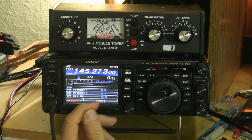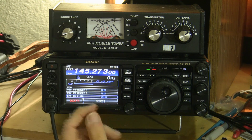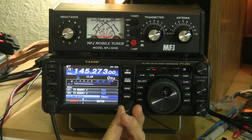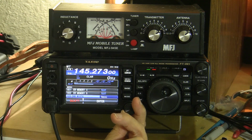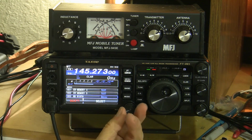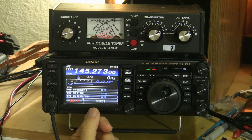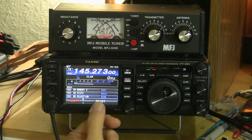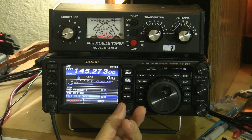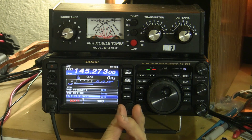As this radio comes, the noise blanker bandwidth is, oops. Highlight the one you want, Jim. Set to 3 milliseconds. It can be 10 milliseconds. It can be as little as 1 millisecond. 3 seems to be a real reasonable level. Rejection is 30 dB as it comes from the factory, but of course the higher that rejection is, the higher the distortion will be on your radio when the noise blanker's on. I normally put that at 10, just so you know. It's 10, 30, or 50 dB.